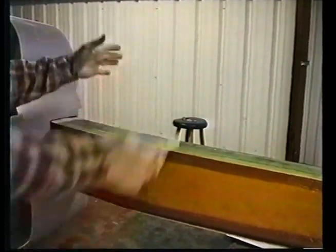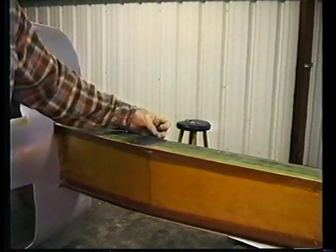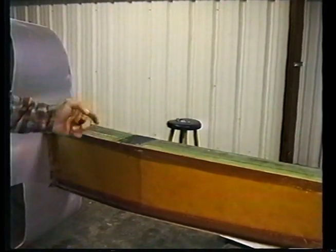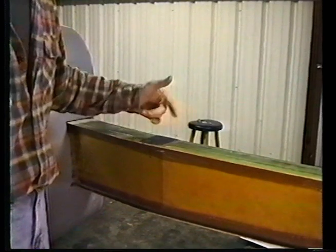Once this is done, I bring the wing up and mate it to the aft face, get the centers of each plate centered over the plates or averaged. You can be actually real close to the edge of the plate and still have plenty of ability to transfer load to the part safely. We'll drill it, and we'll get back to you as we're drilling in the next step.